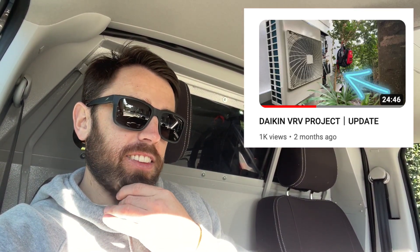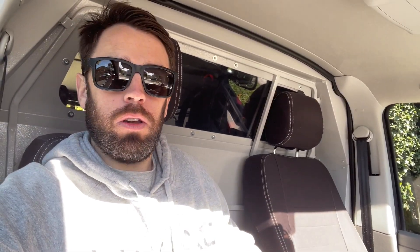The electrical provider in New South Wales is called Ausgrid, and they've done something in the street — basically isolated the power to the street or a few houses. Then at the end of the day when they turned it back on, this brand new VRV system that I've installed is now flashing U1. So obviously the customer rang me and told me.